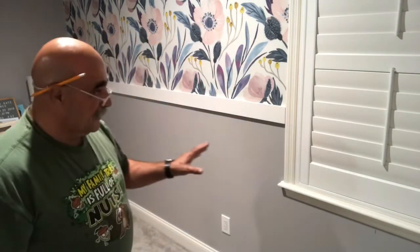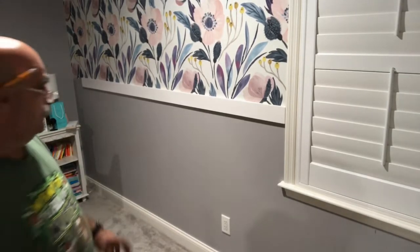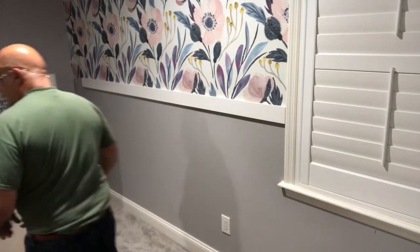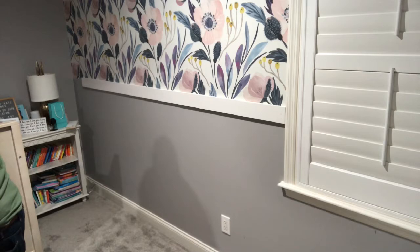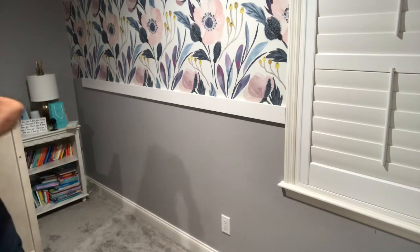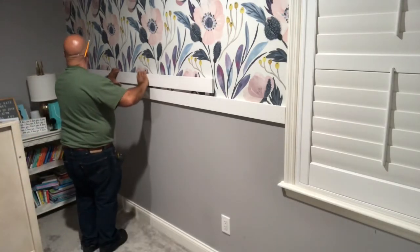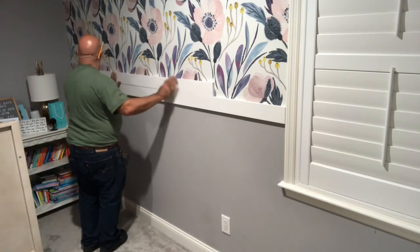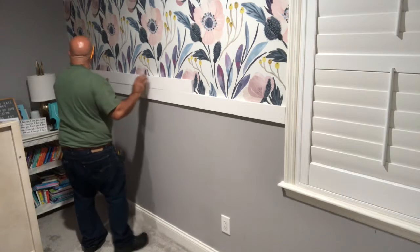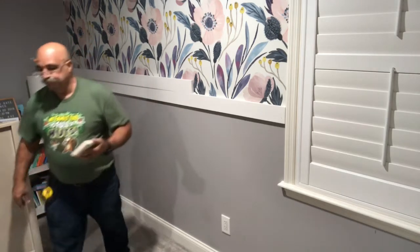All right, now the top rail's in. Okay, now I have a small piece on the end. And how I want to make sure that it's straight is that I use a longer one to put on top, slide it to the wall, don't forget to glue it.